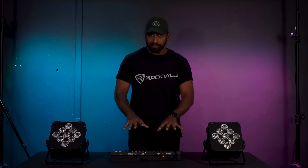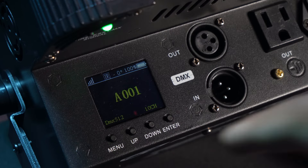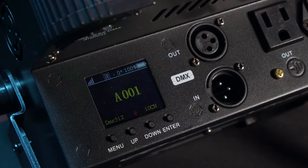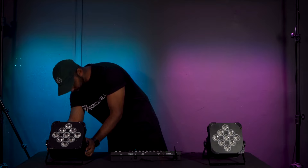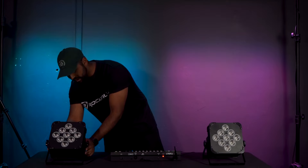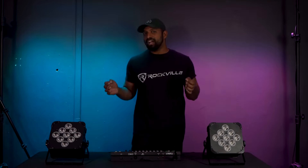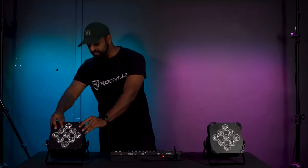Now I'm going to turn on my wireless DMX lights, which in this case are the Best PARs. Before linking wirelessly to the DMX controller, I want to make sure to set the address. The DMX address I want to set in this example is A001 — the first address the DMX controller can read. On both of my lights I'm going to make sure to set them to A001 and press enter on each one.